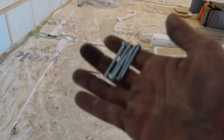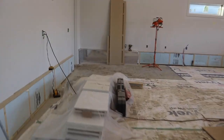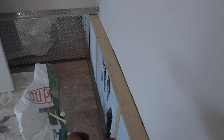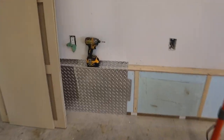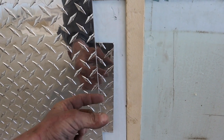I'm hoping I have enough sheets — got five left, so should be good. I'm using self-tapping two-inch metal screws so I don't have to pre-drill anything into the metal, just sink these guys down and we're good to go. Not gluing it on because we want to be able to take the panels off over time. Also putting a little filler strip in behind the panel so I can sink a screw in the middle and drive them both together so they don't flop.